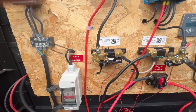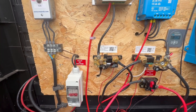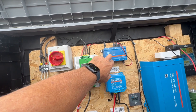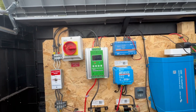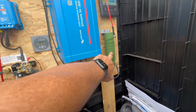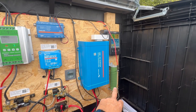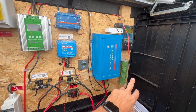Then again the Victron battery monitor, just so we can see the power being generated from the wind and record that. Battery and inverter as before. I'm monitoring everything with the Cerbo GX Victron system — this is giving me all the data from what's going on here, sending it out over Wi-Fi to an access point I've got further away. The only other thing to mention from the wind side is the heat dump. If you ever manage to generate more power than the battery or system needs, it dumps it through here. I've had one of these on another wind turbine for about four years and I've never felt it go warm, but I'm sure one day we'll generate enough to test that.